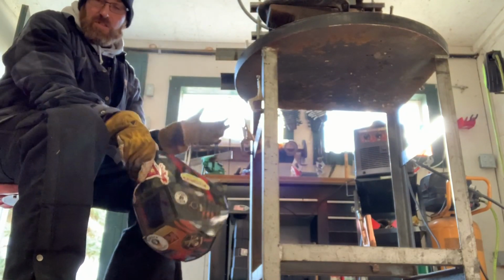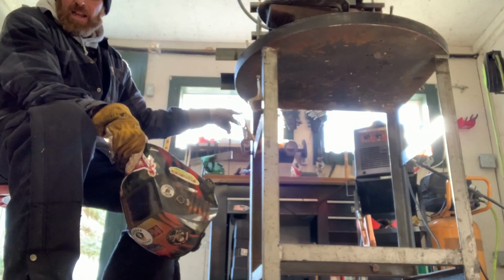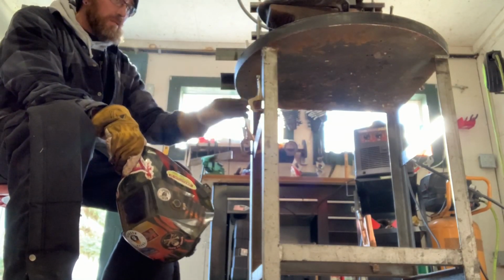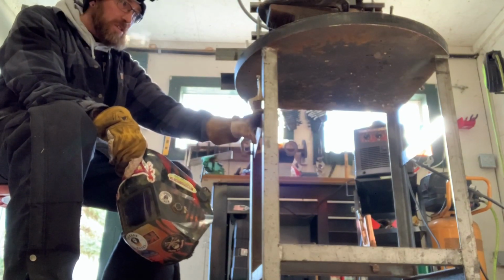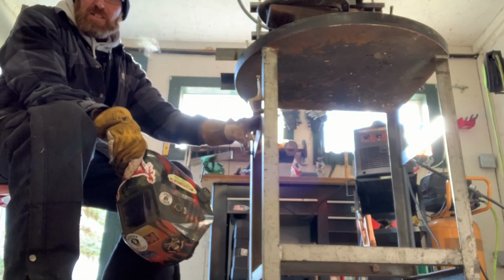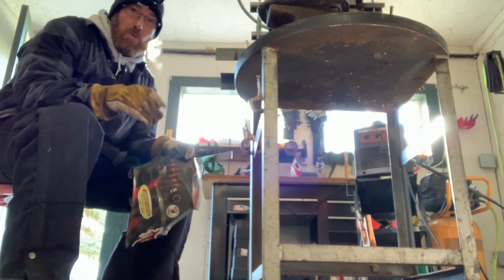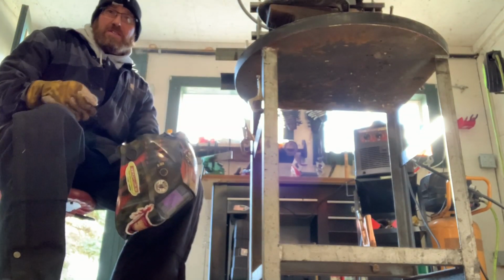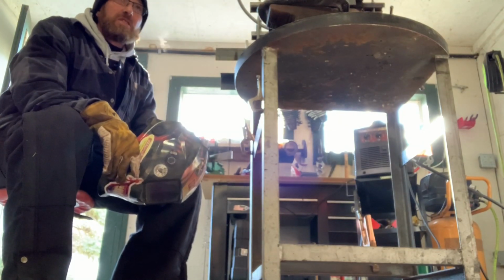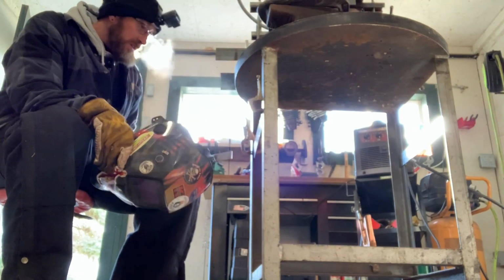So I would highly recommend that when you find your sweet spot, depending on the way that you weld, some people weld fast and they like it hot, some people weld slower and try to get pretty, you write on the chart the dimensions, the thickness of the metal you're using, and the settings that you had. This way you can just go right to it. I'm still using the 350Ps and the 250Ps because I weld at my day job quite often.